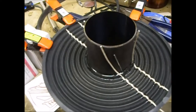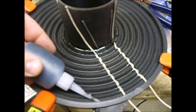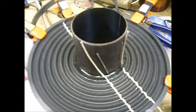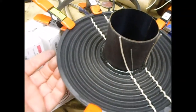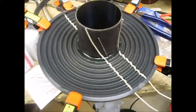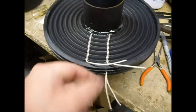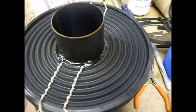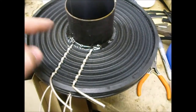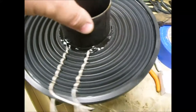I've clamped the spacer in place with the leads coming out of the notches. I'll go around the inside with a light bead so I know the spider is attached to the spacer. When I glue it in the bottom I just lay down a nice bead and it'll soak through and grab everything. I'll repeat this on all three spacers. All three spiders are complete — the top one we just let come over the top, wind the lead around the tinsel, solder with aluminum solder, tuck it down, then put epoxy underneath and on top to encapsulate it.